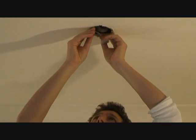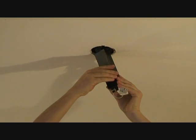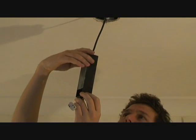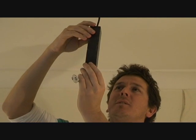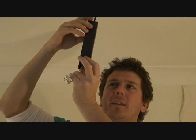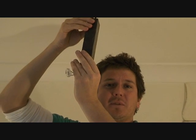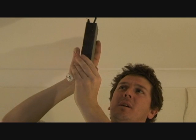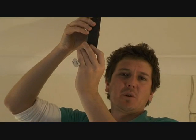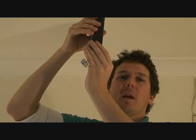We're going to withdraw the transformer, which can either be a large black unit or any colour, such as this one. This is a ferrous core transformer, and these typically add an extra 6 to 16 watts of energy consumption onto the halogen downlight — effectively making that little globe use more energy than a single 60-watt normal light globe. You can get smaller electronic transformers about the size of a small chocolate bar that use between 2 and 5 watts, but even so, you're still looking at a minimum of about 56 watts for a 50-watt halogen downlight.